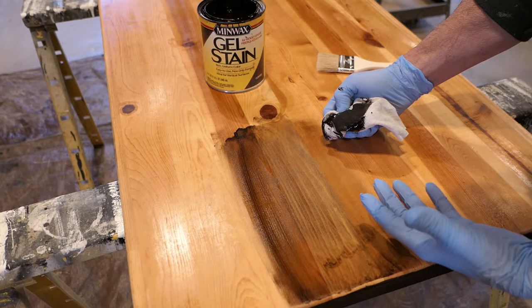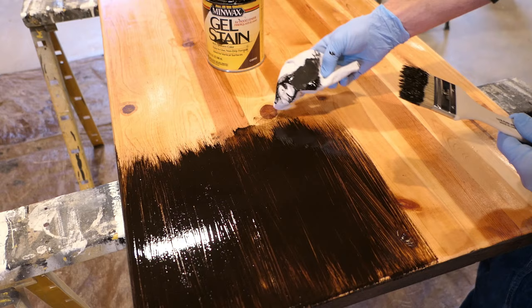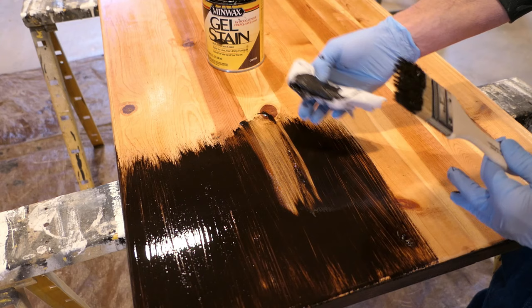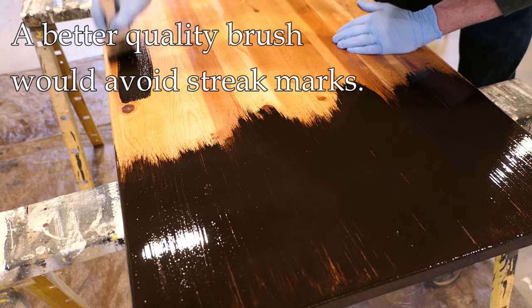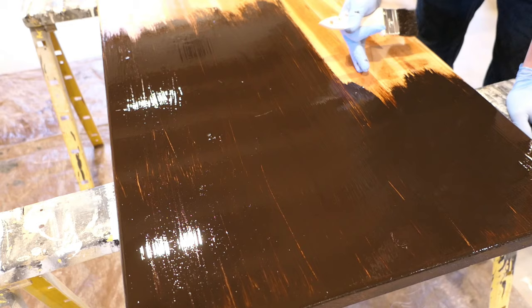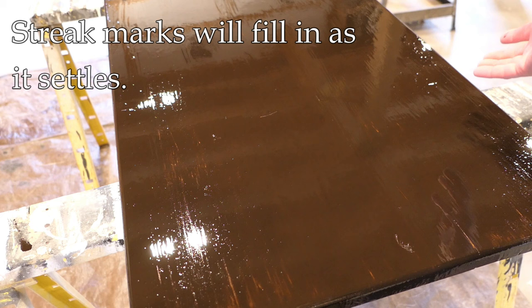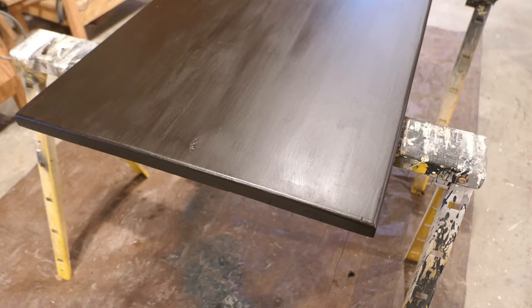With a brush you can really lay this stuff on, and that's okay. This is a cheap chip brush. A glaze is forgiving in the sense that if you make a mistake you can wipe it off. If you put too much on, not a big deal — you can take it off. When you're laying glaze on this thickly, you're not going to see any of the grain, knots, or any of the wood underneath — it really covers everything. As this dries, that shininess will dull down, and that's when you know it's starting to dry. That can take as little as a couple of hours or overnight, depending on conditions, humidity, and the brand of glaze.